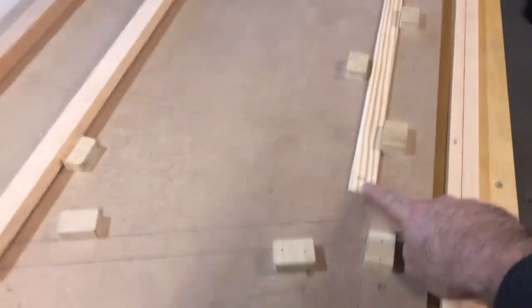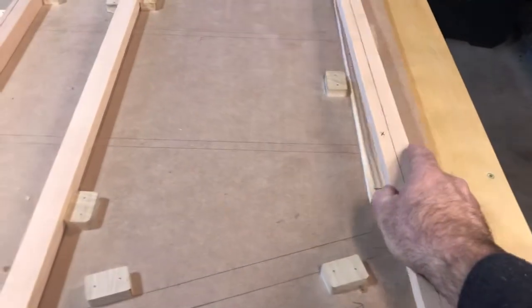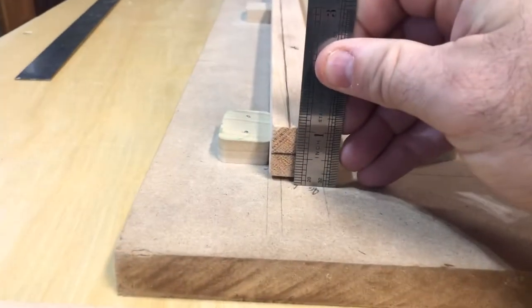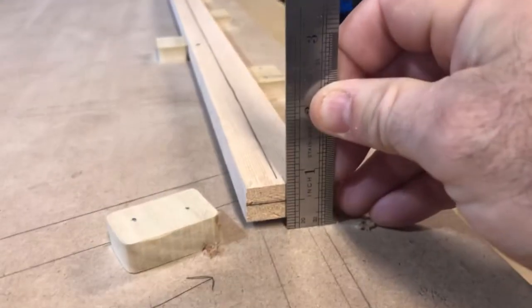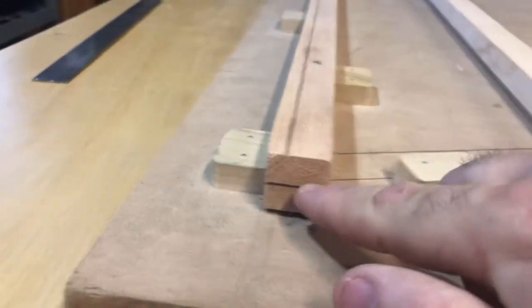There's another shim here, because this piece is only five-eighths of an inch thick. Again, you have to elevate this piece of wood with a shim, which I custom cut on the table saw, underneath it. Then you get a nice fit, and the half-inch marks of all of these pieces are at a half inch. This is now elevated enough to keep all the center lines centered.